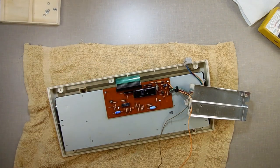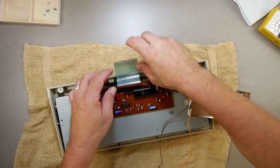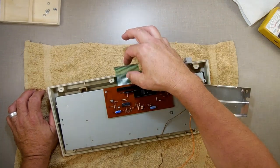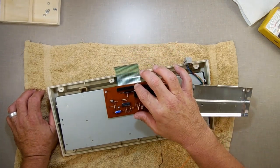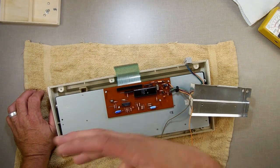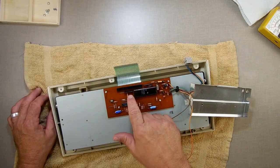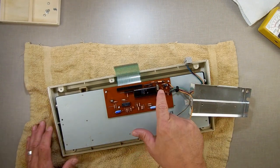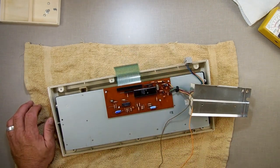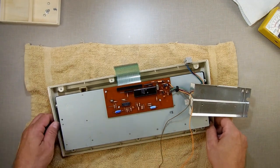I just want to find out which connection that one is, because we know this thing works out there. And logically, and it could be wrong, that row has to be the issue. Because for it to have a problem with 8 columns, but only on that row, is impossible. Now, it is quite possible something else is broken. Maybe a resistor on here is broken. Maybe something on the actual board is bad. That's always a possibility, but I'm checking the mechanicals right now. And if that turns out to be the case, I'll swap a part and narrow it down.